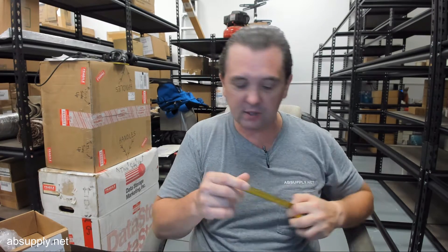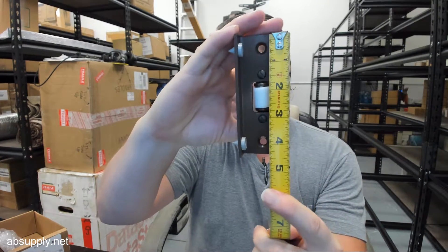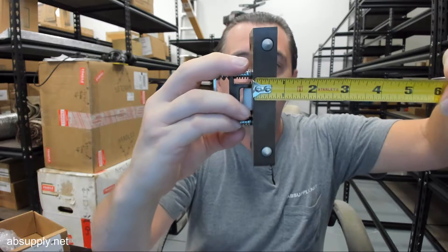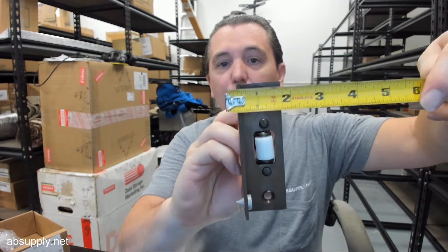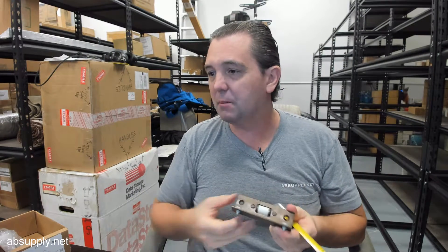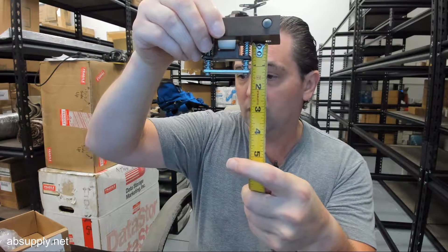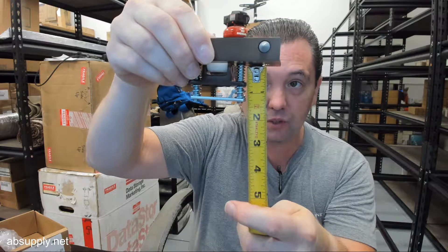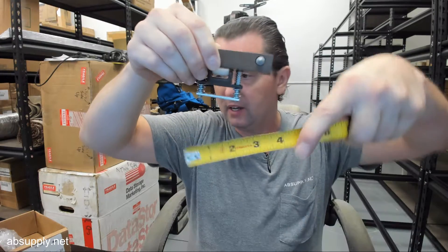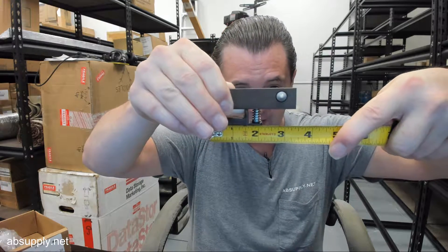There is a link below this video to the document called Template, which is going to give us the dimensional properties of the item itself. Overall height of the unit: 4½ inches. They've got a width of the stop at 3¼ inches, an overall width of the unit at 1½ inches, and then they've got some body dimensions in the sense of what you need to prep for the door — 1¾ inch mortise depth, and an overall width of the body at 2½ inches.